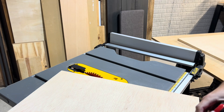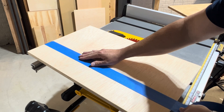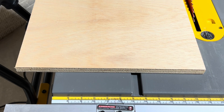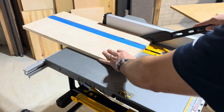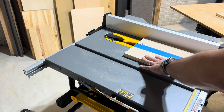I double checked that it was 17 inches, as the runners we will cover shortly are also 17 inches and will be installed under the base. For the front and rear fence I also used three quarter inch plywood. I used the tape method cutting across the grain again and ripped four pieces at three and a half inches for the height; the width was already 24 inches.